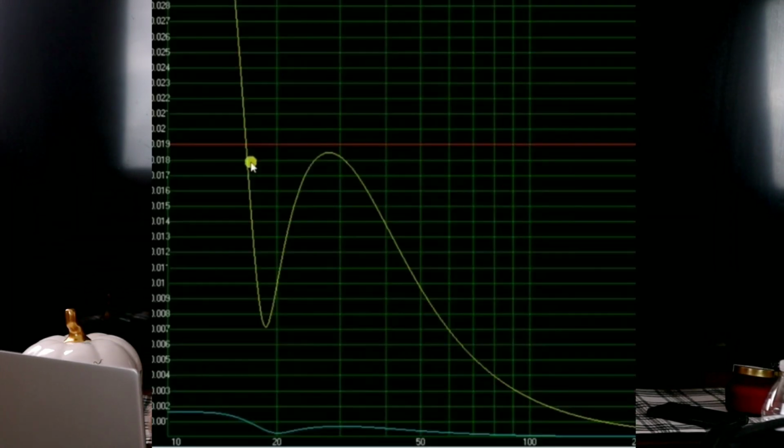All right, so let's look back at WinISD because it shows you what happens below tuning when we apply power. Now we've got just whatever, RMS, I think this is 600 watts on this driver. And you see this tab right here, it's showing us excursion. That's how much movement we have and our cone is moving at different frequencies. And as you see below tuning, it's just skyrocketing. Our cone is moving back and forth much more than it should, but we're limited. All drivers are limited, and that's going to be its Xmax.